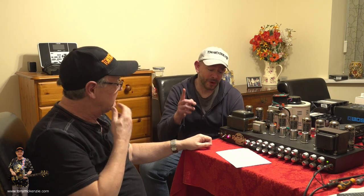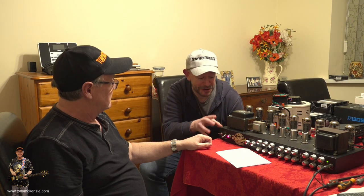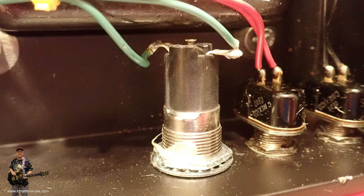One other thing — there's a little red light here, but it should have been purple. I've got the original one here somewhere; I just unscrewed that one and screwed the other in. Also, when changing the power supply over, you've really got to watch yourself because the connectors can short out on your power supply if you're not careful. Make sure you keep everything nicely spread apart. That's because we used a new power supply that was a slightly different size to the original — just enough to cause you a problem if you're not paying attention.